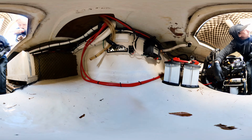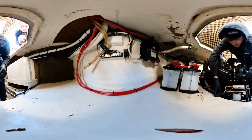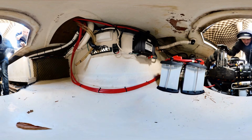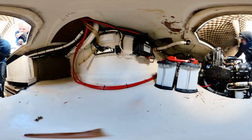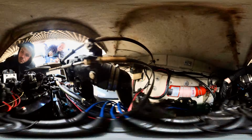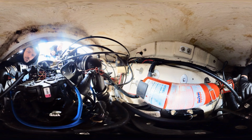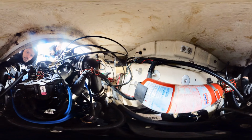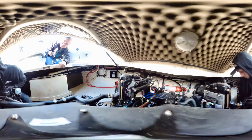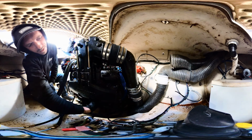Get every angle. So point things out, and it'll have them on video. So I'm just unplugging this because of what I was talking about, taking fuel and fire away from it. Right. And then back on this side is our ignition coil. So I'm just going to unplug that. Sometimes they're a little stubborn. And then from there, we'll just take all of these spark plug wires off.